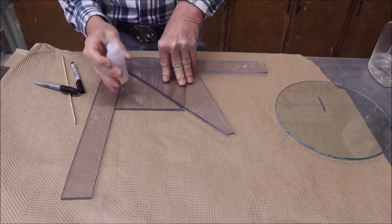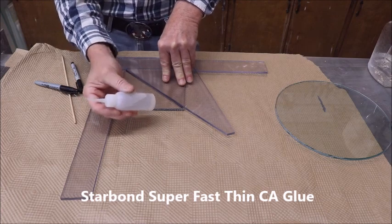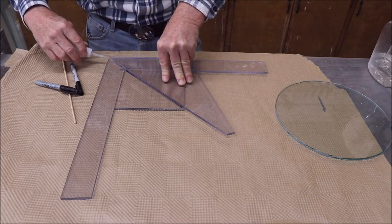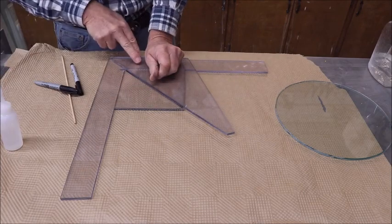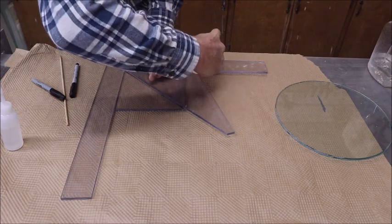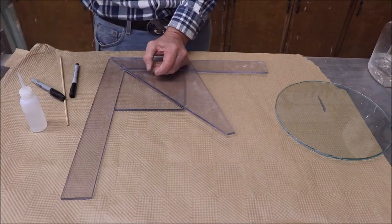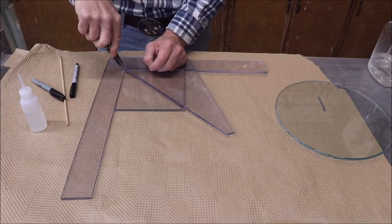I'm going to draw a line just for grins and giggles. Be real careful with this - I use SuperFast, a super glue product. The reason I use this is it wicks - it will run all up under the place where you have it glued together. You just put it down there and it'll run under it the long ways, then you can run it under this side the same way. I use some accelerator - I don't care if they call it super glue. Some of you probably aren't old enough to remember when this stuff first came out and they said 'instant glue' - well, some things it's instant, like your fingers. The other stuff, not so instant.